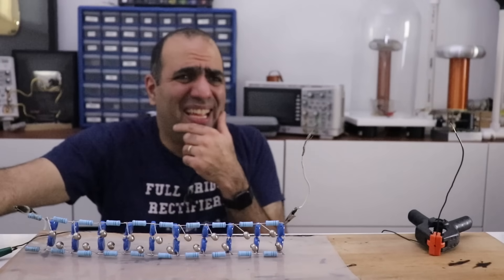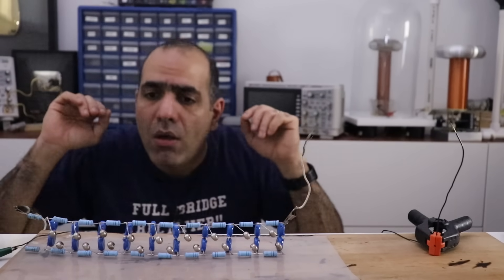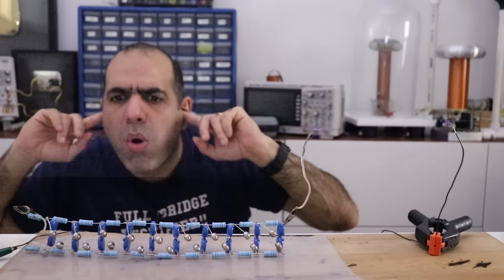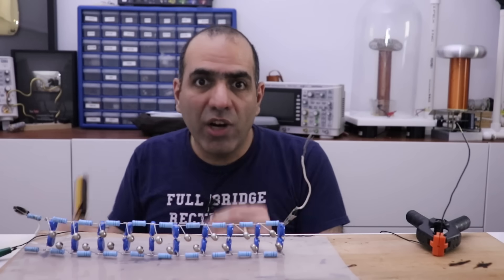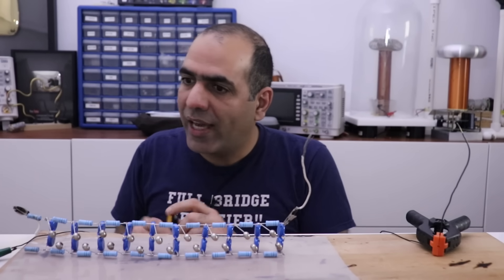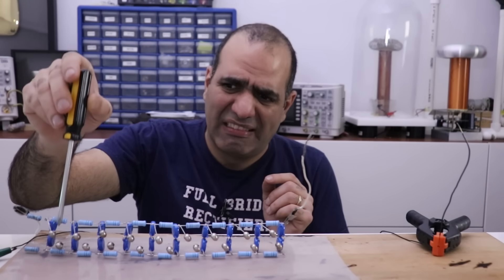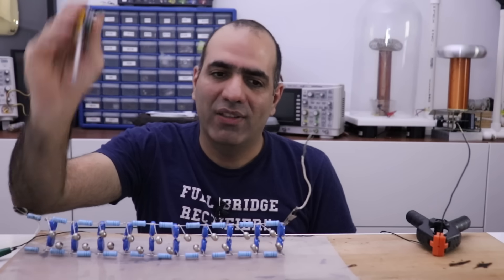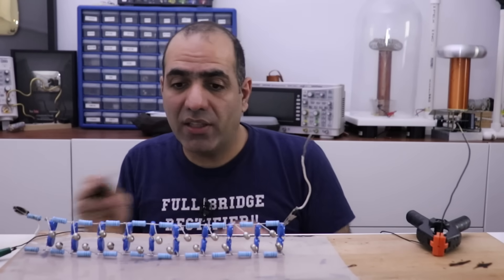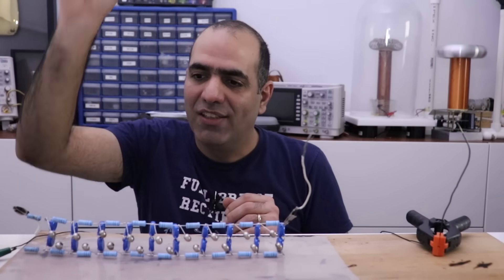Higher voltage. It's starting to continuously arc. There is another way to run the circuit — right now I'm running my supply voltage at a lower level so the circuit doesn't trigger automatically. And then externally I can trigger the circuit. Say, with my screwdriver, I can short the first gap, and it jumps. Which might be good, because it takes a couple of seconds for all the capacitors to fully charge. So this way, I can give it time to charge and then trigger the circuit.